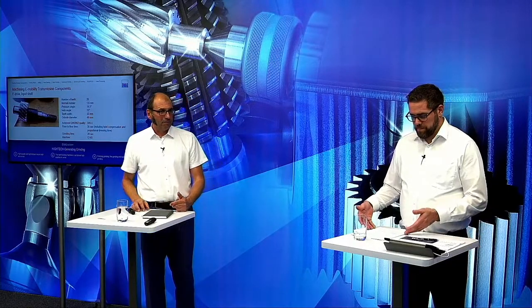Of course, when you ask us something regarding the clamping fixture, we must have really precise clamping fixtures in the machine. When you want to have this kind of quality, everything must be on a really high level. So the clamping fixture must be fine, the balancing must be fine, the dressing unit must be fine, and the stiffness of the machine must also be good. And this creates this kind of result at the end. It's absolutely necessary that there is no weak point in this complete machine, clamping and tooling, because this destroys the kind of quality you've seen before.